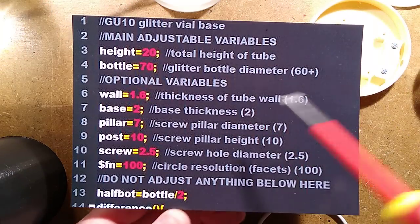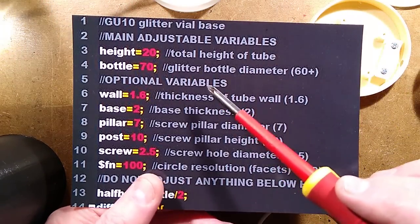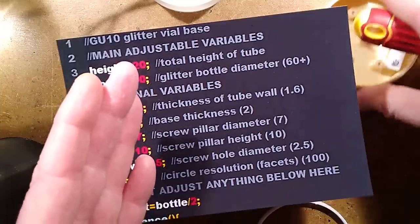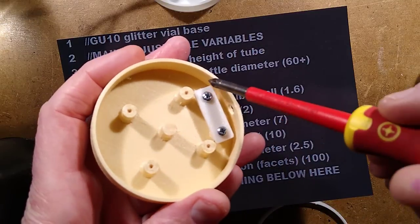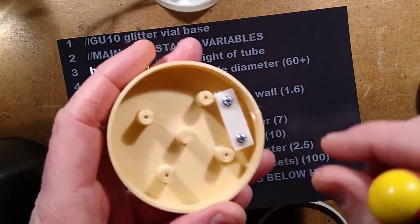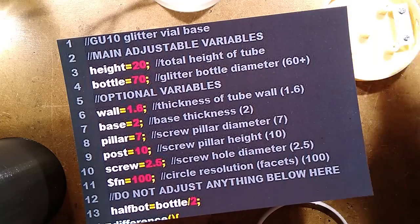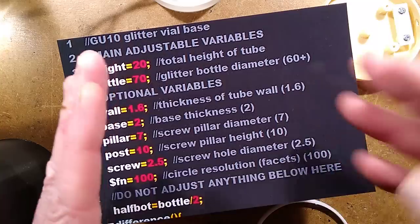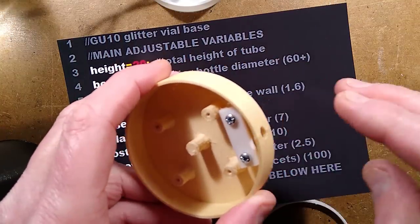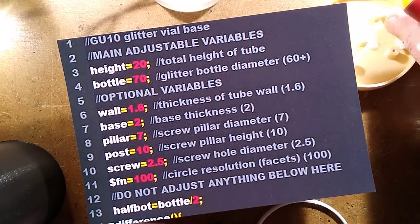But if you want to make any other adjustments, you can. 60 is such that you may have to trim the corners off this because the cable grip will be very close to the edge. As you go bigger, it's less critical. It will just scale everything up, including this 6 millimeter hole for the cable to go in, which will gradually move out with the scaled up size.